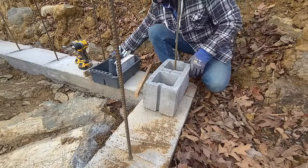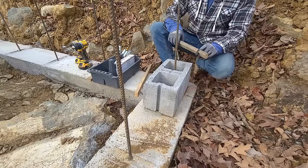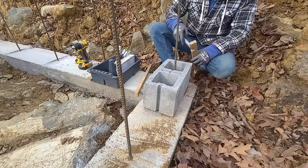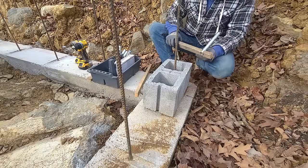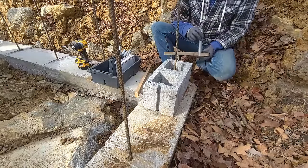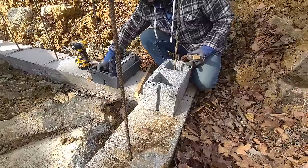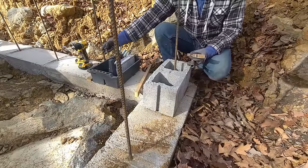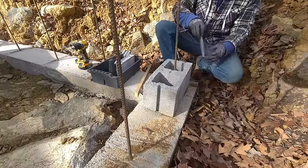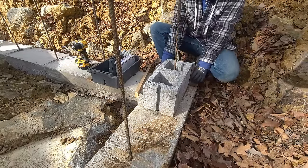Now, I went ahead and made a few of these. This is a bad one. Here we go. I made a few of these and pre-drilled a few holes, but more importantly, I pre-drilled a hole that can fit 3/4 EMT. Here it is. It slips right in there with a little convincing, and it's staying put. Now, I'm going to just take some lag screws, like so, and get this in the position that I need it so that this piece of conduit goes right on the corner.